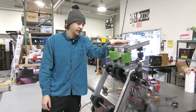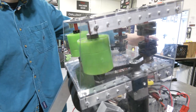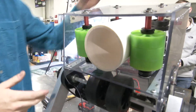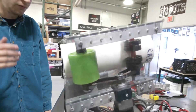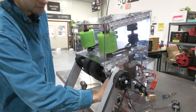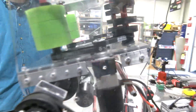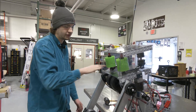Moving over to our coral end of the end effector. We're driving this using compression wheels on the side of the coral — using a total of a half inch compression, compressing to about a half inch between the wheels. On the rear side we're using two-inch thrifty-bot squishy wheels; on the front side we're using AndyMark three-inch compliant 35A green wheels. To power these we're using two Neos run into four-to-one AndyMark Sport gearboxes, driven by pulleys that belt to each of the wheels. In total this is a four-to-one gearbox driving both sides. Our incline is set to about 12.5 degrees.